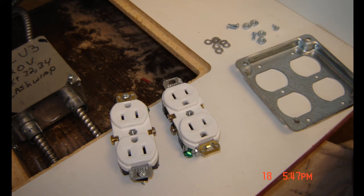These are the self-grounding receptacles I was talking about. These can be used on industrial cover plates without a separate equipment ground wire. Basically, what it says is a listed exposed work cover shall be permitted to be the grounding and bonding means when: one, the device is attached to the cover with at least two fasteners that are permanent, such as a rivet or a thread-locking or screw-locking means; and two, when the cover mounting holes are located on a flat, non-raised portion of the cover. So with these screws acting as a screw-locking means on the flat portion of the industrial cover, you may not necessarily need a separate ground wire — but I still think you should run a pigtail in there to be fully covered.